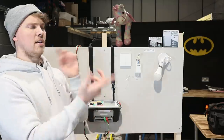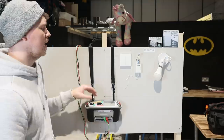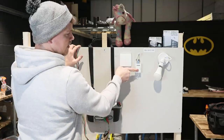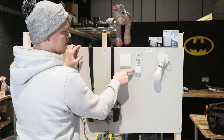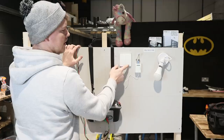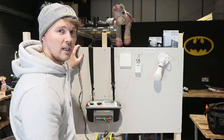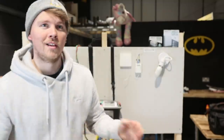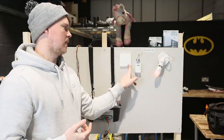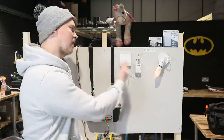So I'm going to chuck 500 volts down this today. I'll show you how to pair this up — I've already wired it in on my board here. Simple pairing: hold the receiver button for four seconds, wait for the red light, press the switch once — that's now paired. I think I've got a broken LED — this one's been clattering around in the van for about a year. That's why I had to drop it off the job the other day. We can see it's on and working.